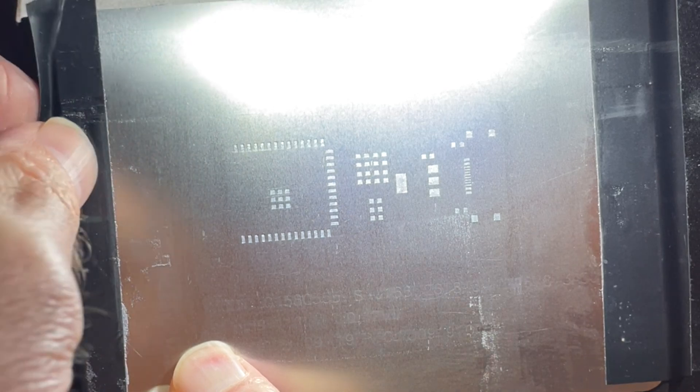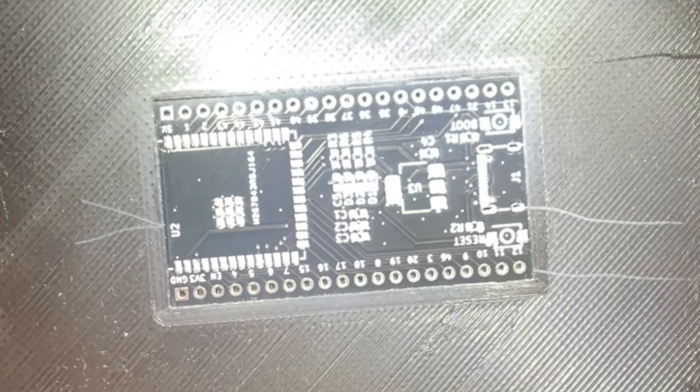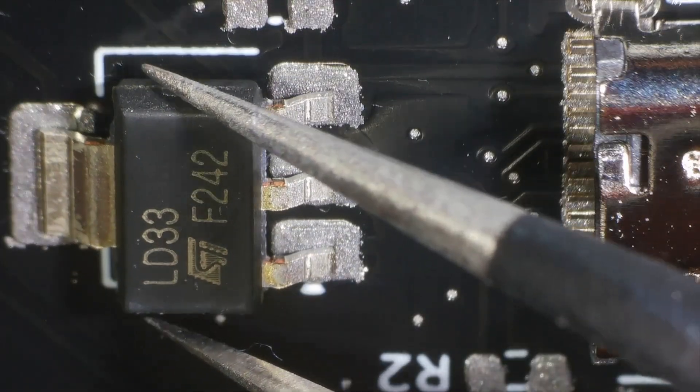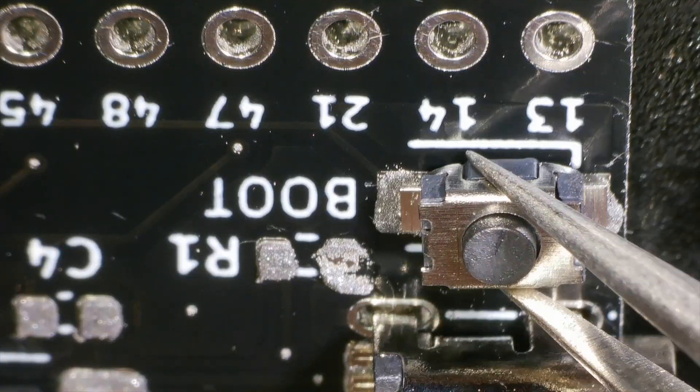Let's get on with assembling it. The easiest way to get these boards assembled is to use the provided stencil from PCBWay. I've already done that here. I taped the stencil down, put the solder paste on and then used my spudger to squeeze the solder paste onto the actual pads. Now it didn't come out perfectly - I wasn't quite flat - but we just need to place the components now and then we'll put it on the hot plate and melt all the solder.